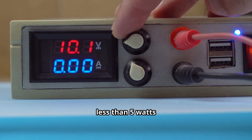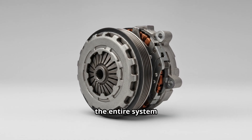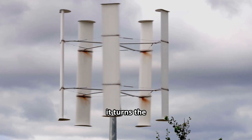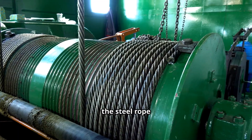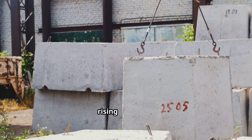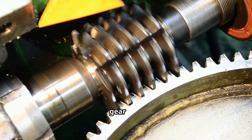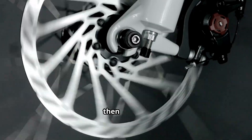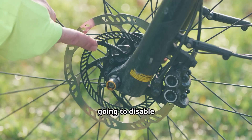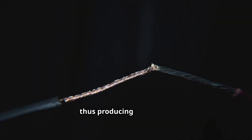Make sure the weight gets picked up even at the lowest possible wind speed. To get the weight picked up you will have to power the electromagnetic clutch — not to worry, because it draws less than five watts and even a mobile charger can turn it on. As soon as you turn on the electromagnet, the entire system connects mechanically. So when the wind blows, it turns the vertical wind turbine, which then gradually picks up the weight tied to the steel rope connecting the drum pulley. This weight keeps rising, and when the wind stops the weight does not fall down because the right-angle worm gearbox prevents any reverse movement. When the weight reaches the top position, apply the bicycle brakes to hold it. When you need electricity, simply disable the brakes and the weight starts falling, rotating the generator shaft and producing electricity.